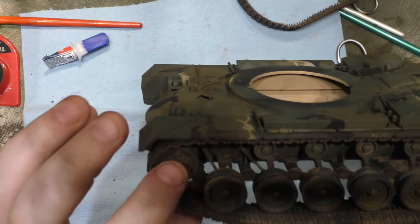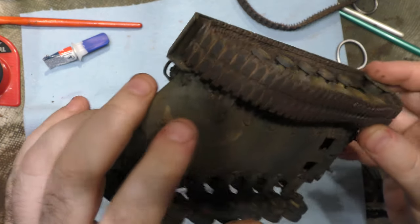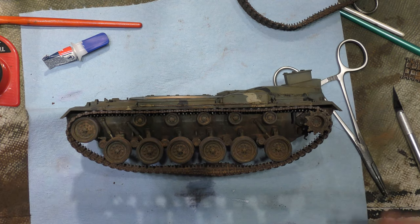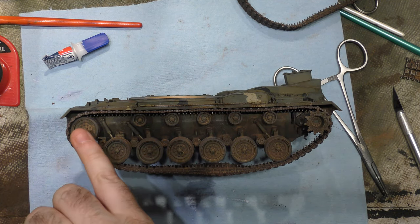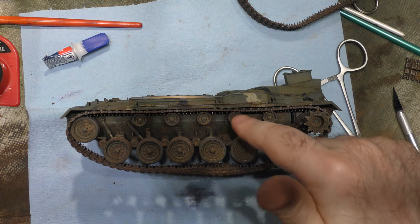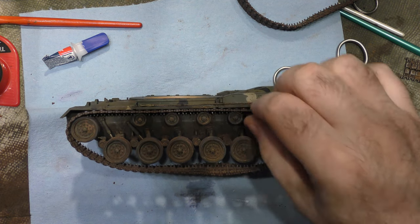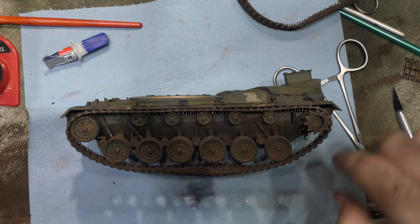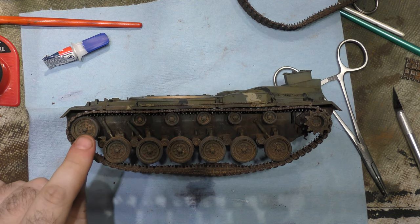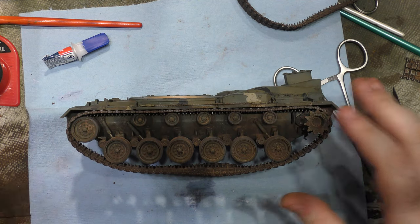So do you see how on this idler wheel, this would also be the tensioner wheel, and there's another little pneumatic thing over there. What they would do is there's always a certain amount of proper tension that an armored crew is supposed to adjust that with, and that is adjustable. And sometimes they measure it with a 2x4, or there's an actual measurement of how far that track is supposed to be able to flex above the return rollers on the top. And that's how you adjust track tension on a real armored vehicle. You adjust how far forward or back that idler wheel goes.